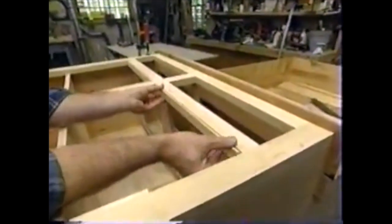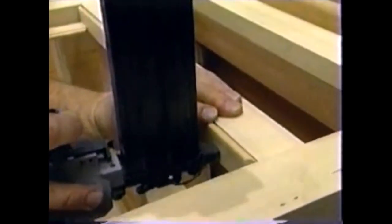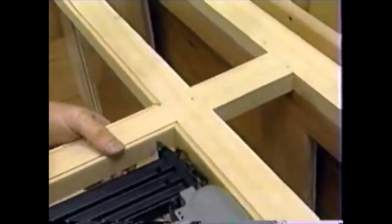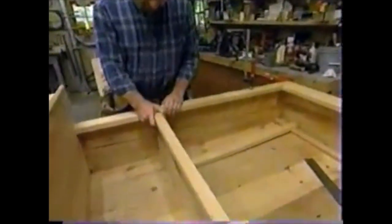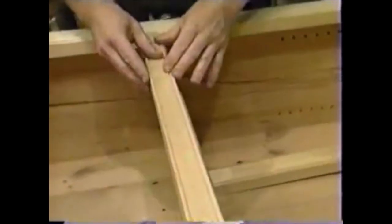I'm wrapping these door openings with small beaded pieces. Over at the router table I use a quarter-inch beading bit — one test pass is all it takes — and the corners are simply mitered. I apply a little glue before assembling them. Up at the drawer openings I'm not going to use this detail because I have overlay drawers. For the upper cabinet's face frame, I machined the beads into the rails and stiles first — faster than applying separate pieces.